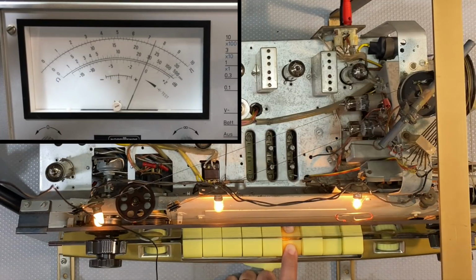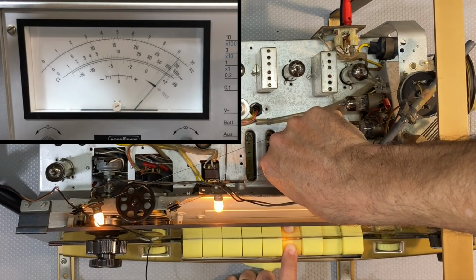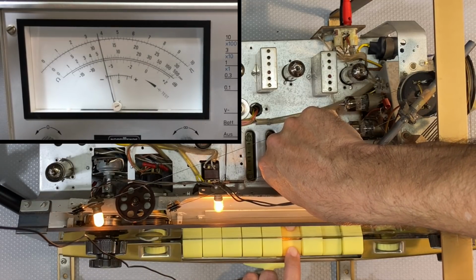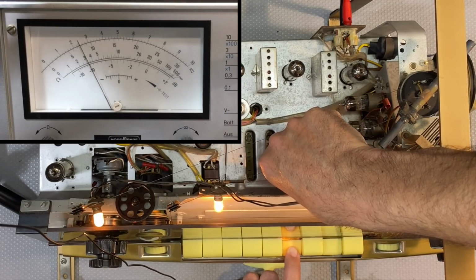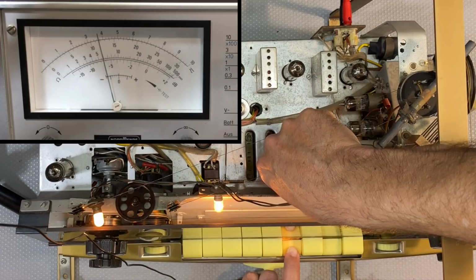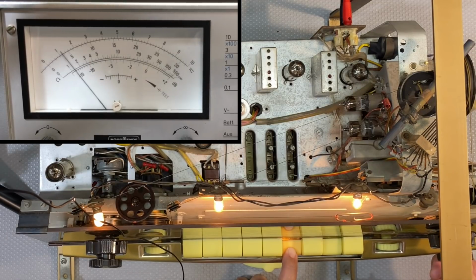There's my peak, or thereabouts. Let's see where it is. Yeah, that's 7.2. Now the antenna coil. Get the volume slightly down. When you push it down, there we go, there's our peak. All right, switch is still dirty, but as you can see, when I hit it, it's there. Take it away, it's gone. But when I check around 7.2, it's exactly on 7.2, that's my peak. And I need to fix that switch.